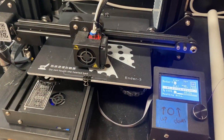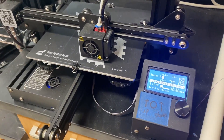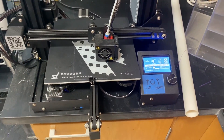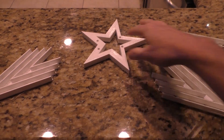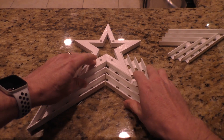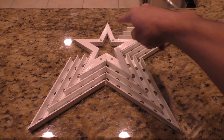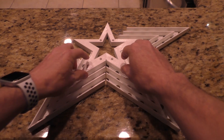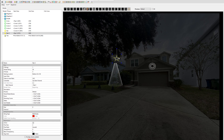The star prints out as 5 different pieces so it can fit on a standard 3D printer. The Thingiverse description suggested joining each part of the star together with epoxy, but when I tried that the whole structure crumbled under the weight of the 120 LEDs it has. So to solve that problem, I created a smaller inner star that would fit onto my 3D printer's bed and could be used to glue each individual star arm together, making the entire structure significantly more rigid. I also included 4 mounting holes on the inner star for attaching your star to your mega tree pole with zip ties. To add it to your Xlights show you're going to make 3 different stars: the outer star with 50 LEDs, the middle star with 40 LEDs, and the interior star with 30 LEDs. Then put all the stars in a group and you're all done.